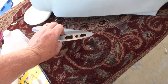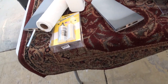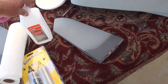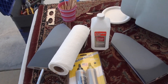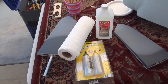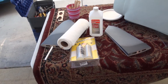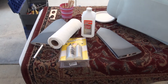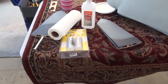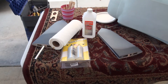Sand it with about 100-grit sandpaper, which makes it easy to do. Right now I'm going to get set up. I've got my alcohol there — just old 91% — and I use that to cut the epoxy and clean as I'm going. Have everything already out there before you mix up your first dose of epoxy. Try to make enough — don't be stingy with epoxy. It's cheap. It's your best friend. Make up enough to do the whole job at one time. So I'm going to make up some stuff here and glue it up and show you what it looks like when we're all said and done.